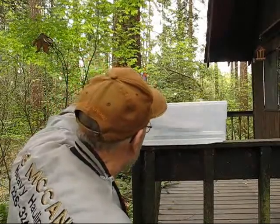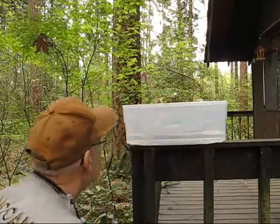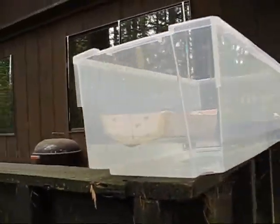Let me go ahead and see what it sets like here in my tank with my surround wrap coating. Setting fairly high out of the water — let me pull the camera off the tripod and we'll do a pan around. There she's sitting on her lines. I'm looking at about maybe three inches in the water, just barely touching on the lower part of the side panel. Looks like it's pretty uniformly about three inches around, maybe four right here ahead of the beam.